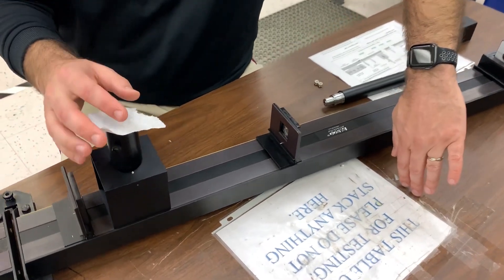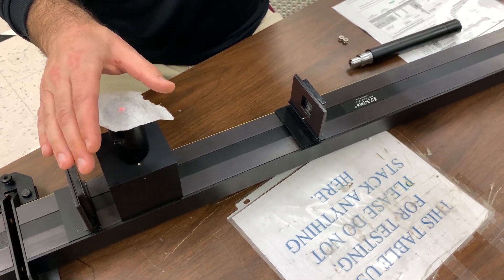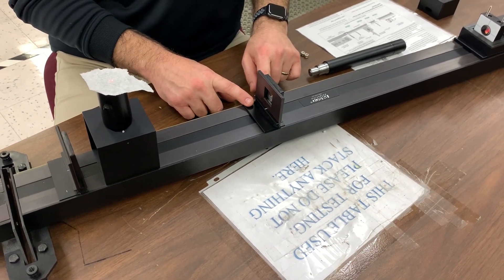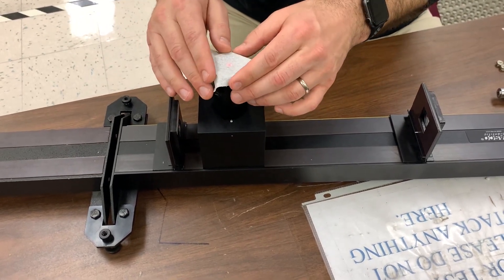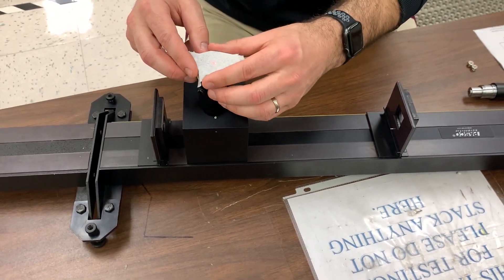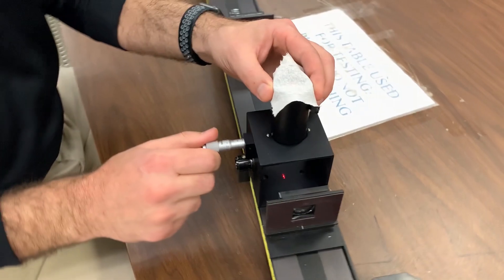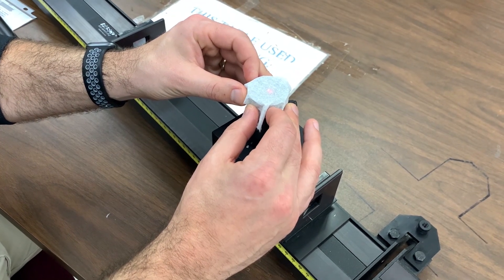When you block it, there's still a small amount of red fuzz — what we care about is that bright spot. You can adjust this lens here, moving it slightly forward or backward, and it will sharpen or make smaller the spot in the housing. Before putting the eyepiece back in, adjust the beam splitter and the micrometer so the spot appears to come right back through the center of the opening where the eyepiece goes.